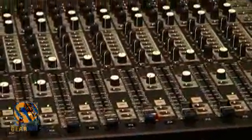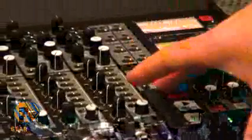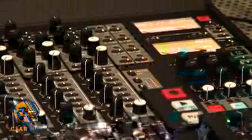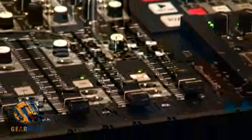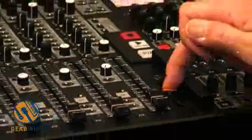On this version, it's 8 channels. It allows also to have an AD section — an 8-channel AD section — and even the recorder is inside. The recorder has a hard disk unit here, up to 60GB, and also a compact flash card. This way, we can record easily the 8 channels to the hard disk, and make a mix down of 2 channels on the compact flash.